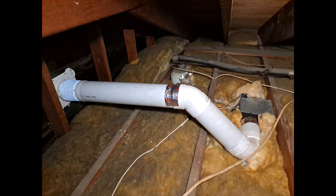Here's a view of the completed installation. You can see I've replaced the insulation around the fan. The PVC pipe was glued together with PVC cement. Where it's fixed onto the flange on the wall to the outside, I also put silicone sealant around there just to make sure that was a good seal. There was a slight leak because it was a loose fit on the 45-degree elbow, and that's the reason for the metal tape over there.